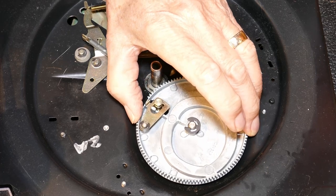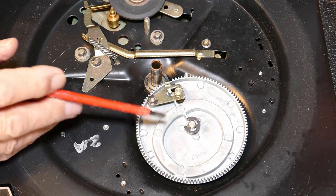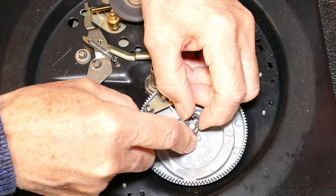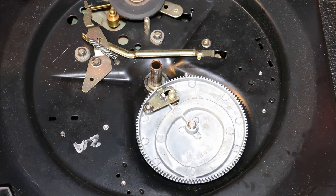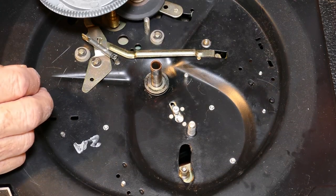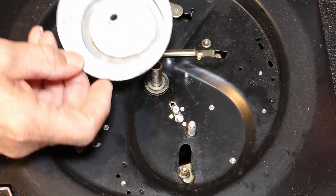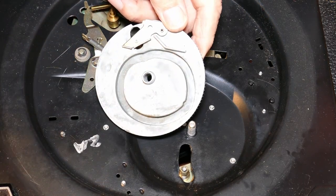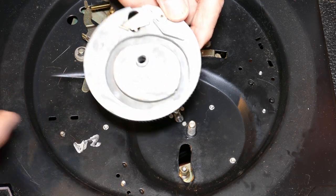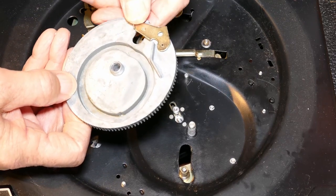There's a lot of friction in the mechanism which shouldn't be there at all. I had to remove the complete mechanism, which is a reasonably simple job — just had to remove the circlip at the center, click that off, and we're free to lift the whole mechanism off its spindle. It was a little bit tight due to some light corrosion on the surface of the spindle. We can see the track that the cam follower runs in and that will need to be lubricated. Checking the trip pull again and you can see it's really really stiff.